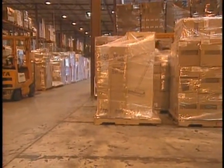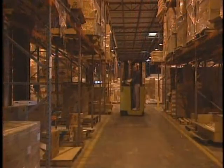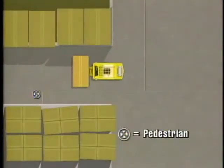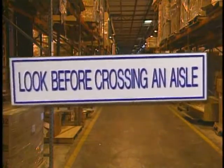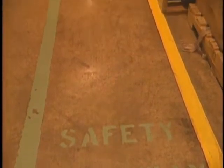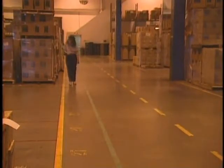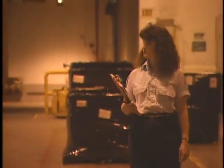Also, since the operator's attention is often focused on making sure the load is properly balanced and secure, he or she may not be completely aware of other activity in the area. You may not know that when a lift truck is turning, the back end of the truck initiates the turn, which is called rear-end swing. This is just the opposite of your car. In addition, lift trucks are required to be operated in reverse when the load blocks the operator's view. Therefore, the driver will be scanning to the rear and sides. If you approach from behind when the driver is turning, the driver may not be able to see you at all. There are a number of other things that you can do to help the lift truck driver operate safely: follow any in-plant safety instructions, which are posted for your benefit and safety. Try to walk and work only in designated areas. Avoid taking shortcuts and entering aisles from blind areas. At blind intersections, remember to recheck for a second truck that may be following the first or coming from an opposite location. Before you cross aisles, stop and look both ways.